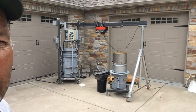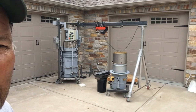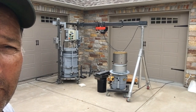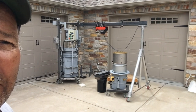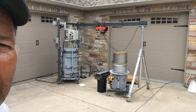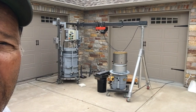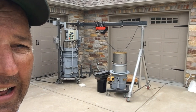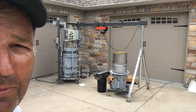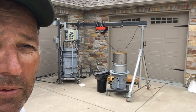Just to recap a little bit, the changes that I made since the last pour are primarily new mold media, mold packing method, a little bit more vibratory energy, and slight changes to the gating on the pattern and positioning of the pattern in the mold. Outside of that, it's basically just round two. So I'm going to do a final skim here and then pour it, and we'll see how it goes.